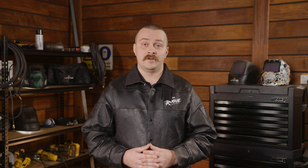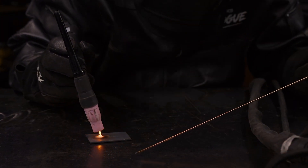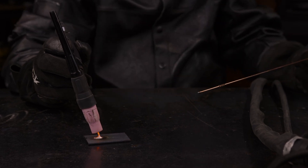One of the main ways that a tungsten becomes contaminated is by dipping it. The first way is by touching the tungsten itself into the workpiece. Not a lot will stick to the tungsten generally and your weld pool should be relatively clean anyway. But if your tip has touched the pool, it will cause a blast of oxide and other contaminations. When you stub your electrode, you might not always lose the tip's shape, but the next time you weld with it, it's going to blow all sorts of contaminants into the start of your weld.